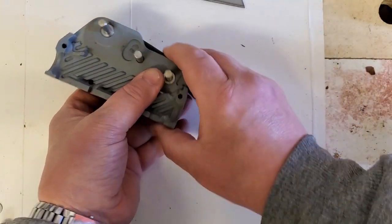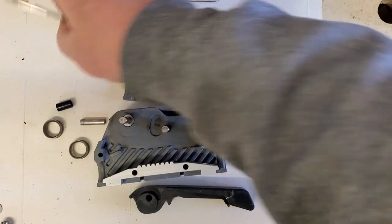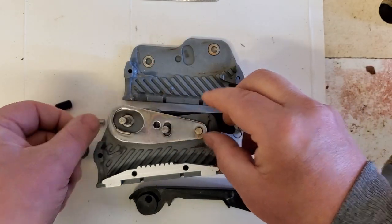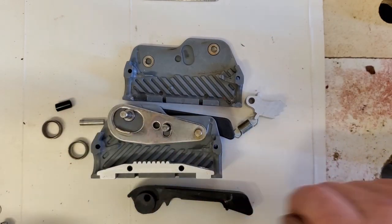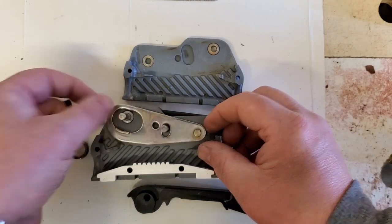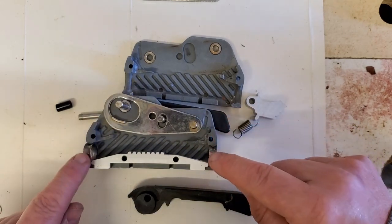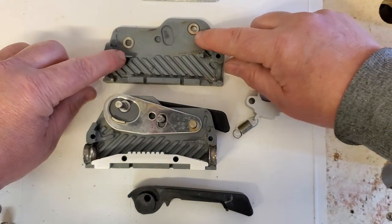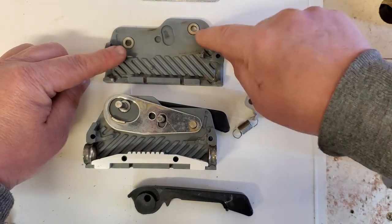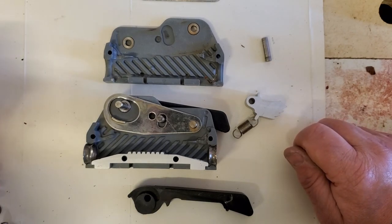This is looking good, and now to build the second side — it's pretty much the same as before. Get a stainless steel plate, make sure the straight edge is at the top. Put your fairing rings in — it's quite easy to forget these so make sure you don't forget those. In the final side plate put the two shaped washers in again with the rounded side facing down.